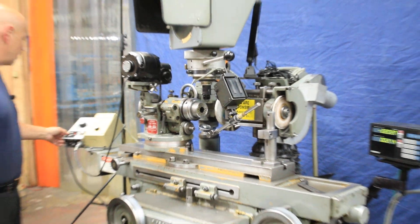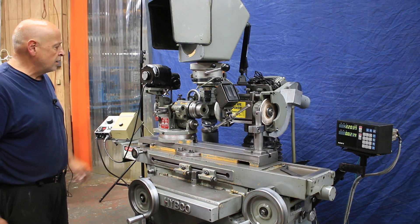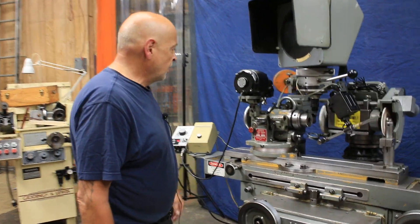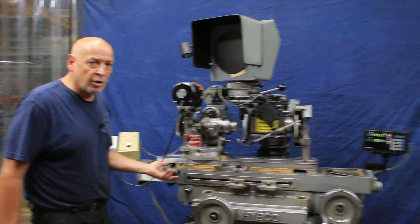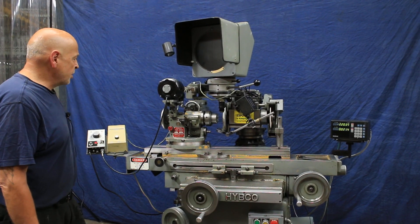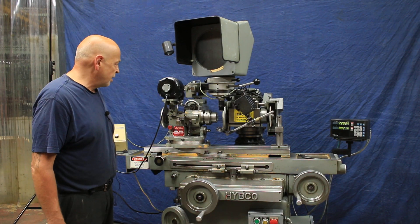The comparator or work head here is motor driven, or you can also use it by hand. You could use it for straight grinding or for relief grinding. We have several cams — they're all listed on our quotation and in the photographs — but it's got a good selection of cams and also the indexing rings in there.